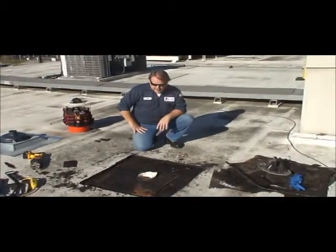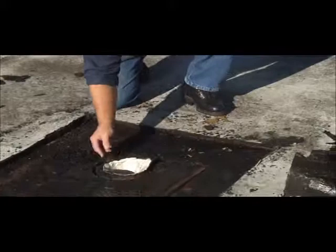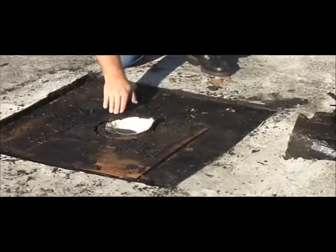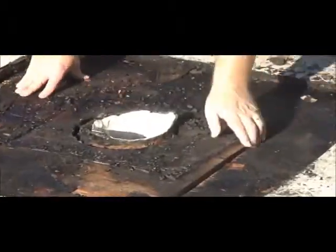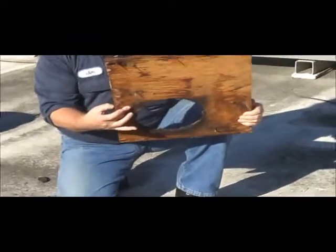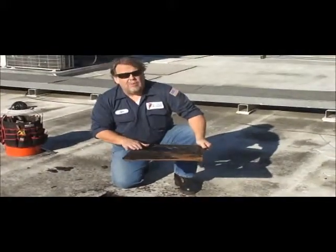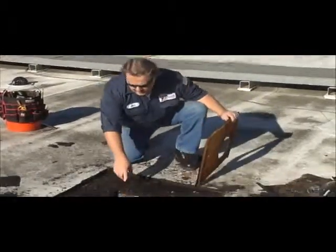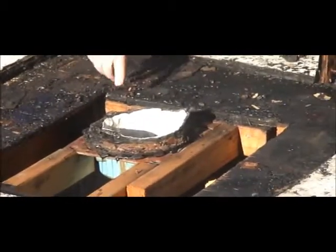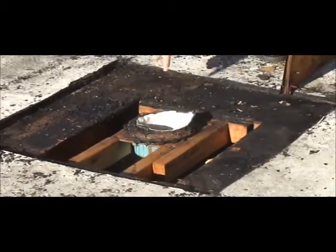What we have here is a roof drain — some kind of device they made to go down into the roof drain. What's wrong with this drain is they mounted it to the bottom of the plywood, which it should not be. The roof drain should be sitting on top of the plywood. Because it's so poorly installed, it was continually leaking down inside the building, and you can see the rust accumulated around the roof drain itself.